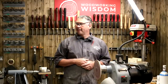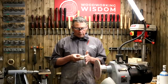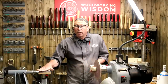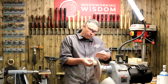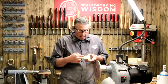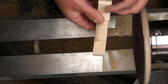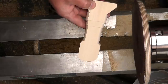And then Simon's asking, why does the center of the sanding disc need to be lined up with the center of the piece? So really, just to give me a nice flat, when I'm starting to raise it like this, I don't want to have, you think we've got to work centrally to the radius if I'm on a table. That's what I'm trying to say. If I'm trying to work up here, as the angle of the disc comes around, instead of a nice straight edge here, it'll be an angle to that sanding area. That's the only reason. You could sand centrally and then you'll have to tilt the piece up, but it's just to keep this nice and straight, basically.